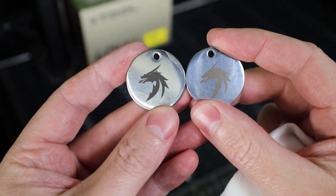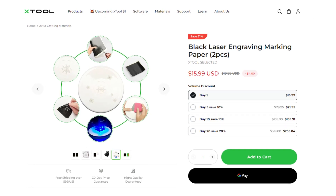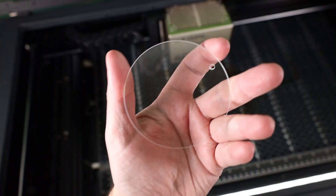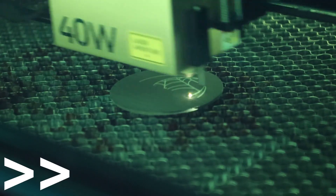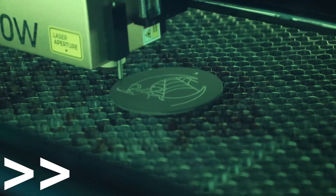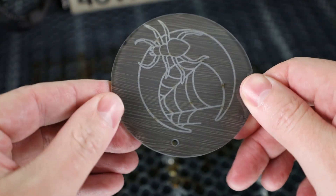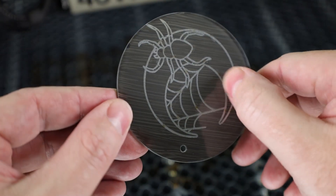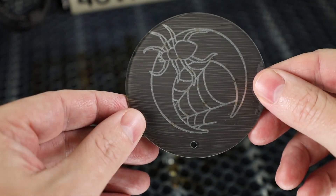With that spray, you can use it on any metal, along with glass and stone. There's also laser marking paper, which is basically just a sticker that you can stick onto metal, stone, or glass and then engrave on it. Since we're on the topic of glass, you can't really do anything with it unless you put a coating on it — for this I just painted on some water-washable paint. Because it has this layer, the laser is able to hit something and it starts to frost the glass. You do have to be careful what's on the other side, because the laser is still passing through. This is one of the times that using a honeycomb bed isn't the best — you can see all the spots where it was touching the honeycomb and the laser was able to mark the back. At least for this it's not the end of the world, just something to watch out for.